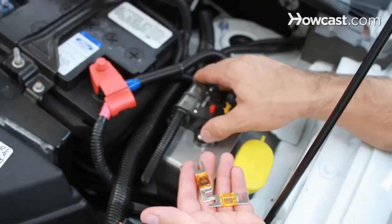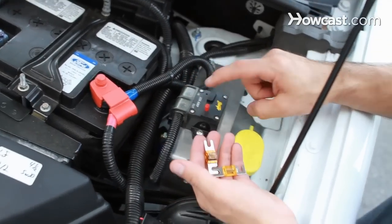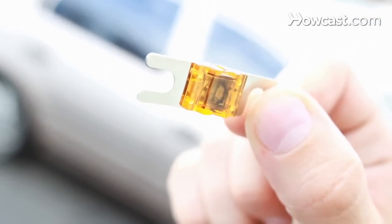If you have a sub amp combo that's dead, one of the first things you should check is the fuse under the hood. Pop the hood, look near the battery and there should be a big power cable coming off of it — usually red or blue or some easy-to-notice color. Oftentimes it's going to be covered with wire loom, which is usually black. Check for the fuse, which is usually going to be anywhere from six to twelve inches from the battery, and see if the fuse is blown. You can usually tell if it's blown because the piece in the middle is going to be split apart. If this fuse is blown, it means either there's a problem with the amplifier, or you might have just played it too loud and overheated and drew too much power.